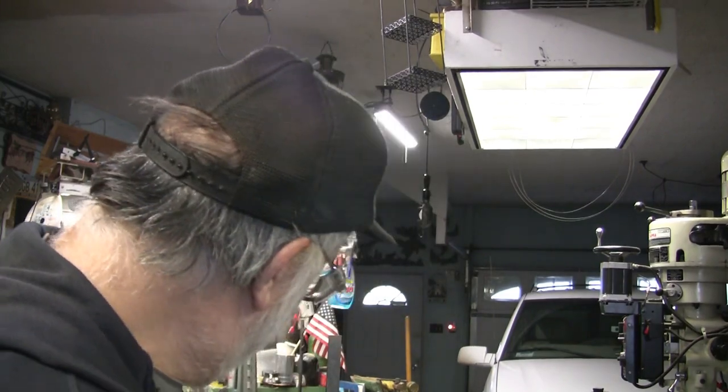I think I'm going to call it quits for today. I got some cleaning up to do. I started to clean up the lathe. I cleaned those stainless chips off and cleaned the ways and made sure there's no coolant sitting on them, and re-oiled everything, and that way she's ready to go. If I work on a displacer, that'll be out of aluminum, or maybe that steel tubing. I don't know yet. I'll have to decide. More than likely it'll be out of aluminum because I don't like the idea of the extra weight on a displacer.